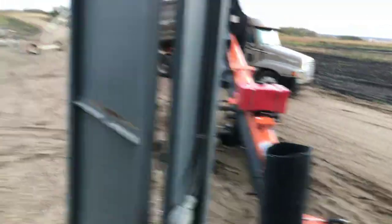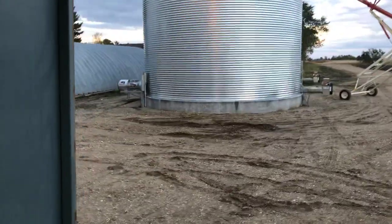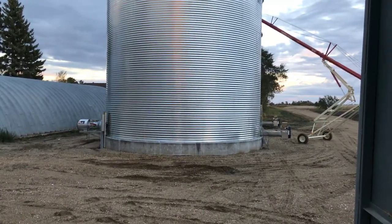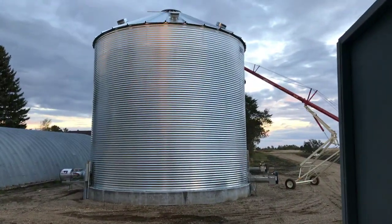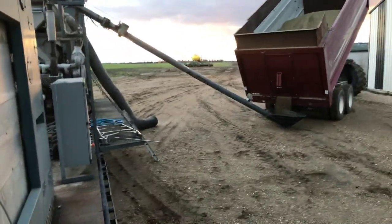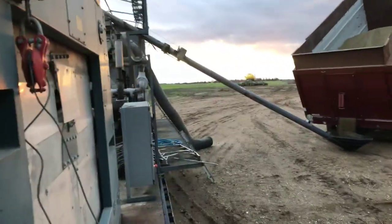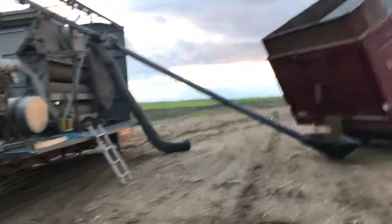The more full you run the auger, the less damage you get. These bins — you can see them in the back corner — we put up this year and they're actually dryer bins. They run a propane heater to dry, so we can dry at low heat without moving it. We'll auger it in there, level off the pile so it's relatively flat, dry it, hopefully get it dry enough, get a sample sent away, and they want to take it pretty soon. Anyway, that's all for me tonight — I'll carry on cleaning, get this done, and call it a day.